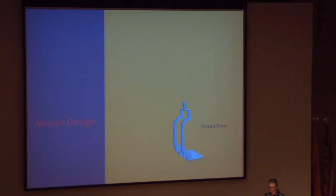This is the mount around the legs — the modulus of rupture around the ankles and the overturning moment. This is where the greatest forces would be. There's about eight to ten inches extending over the plate here. I thought about putting the plate underneath the piece, but that would require more maneuvering of the warrior. I decided to put the whole plate in the back, using 13 lags to hold it into our top deck to make sure it wouldn't overturn.